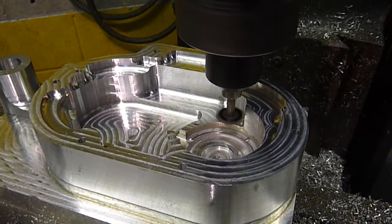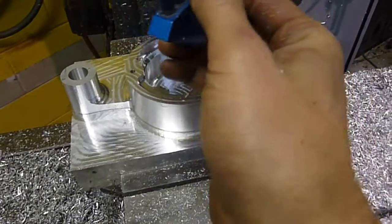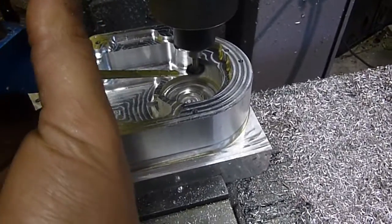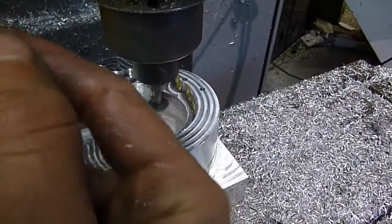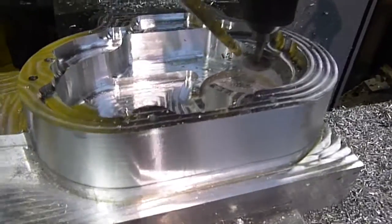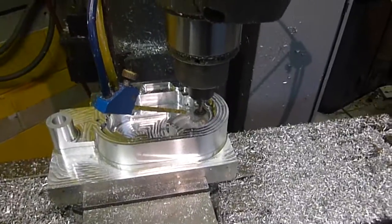And probably wreck your groove. So I'm going to take my time, real slow, no rush. I'm going to put some mist on it. I feel pretty good about the toolpath that HSM generates, so I'm not as concerned about it coming up with any crazy lines of code. My RPM is about a thousand — keeping it pretty low to prevent a lot of chatter.